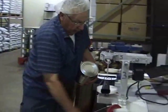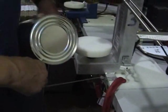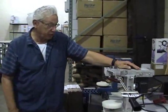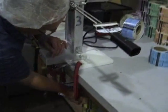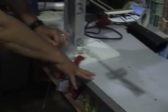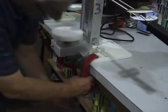And on the canner we have a gauge, and this gauge is to run around the can once you get it sealed to make sure that it goes all the way around, fits down, and doesn't go up. Okay? You've got to make sure that you get it clamped securely because you do put a lot of pressure on it when you do the work. So the clamps here become 2 clamps, and you want it to be secured to a good strong table, one that will withstand the pressures, and enough room for you to do your canning with.